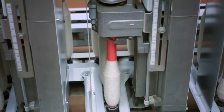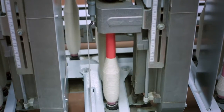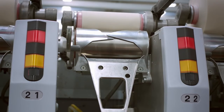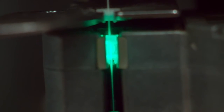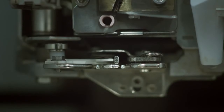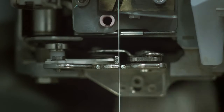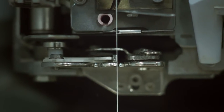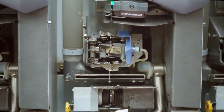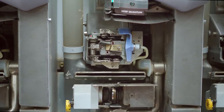In the past, the drawback of ring-spun yarn was that the threads were simply tied together with a knot, which led to weaving faults in the cloth. Now, with this ingenious machine in today's factory, this problem has been solved. The thread ends are glued together under pressure by adding a little water. The machine also monitors the moment when the bobbin reaches the end and needs to be glued to the next bobbin. And if the yarn breaks, a metal arm picks it up and glues it back.